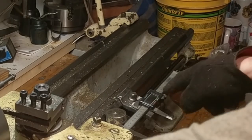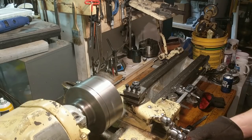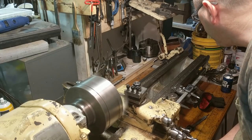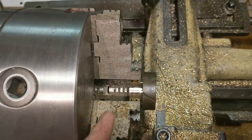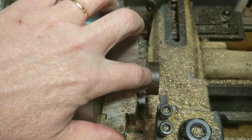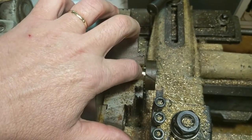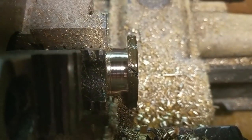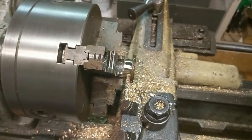I'll touch off and then set the DRO to zero. Zero — now I need to take off 120, so I'll take off 70 first. I've turned about half its length down to one inch, then flipped and re-chucked it. I'll use the parting tool to put in a square notch, leaving 0.175 of a flange there and taking the rest down to one inch to match. The flange is currently measuring about 0.177 — if it's tight I can always touch it to the belt sander later, rather be looking at it than looking for it as Keith Fenner would say.